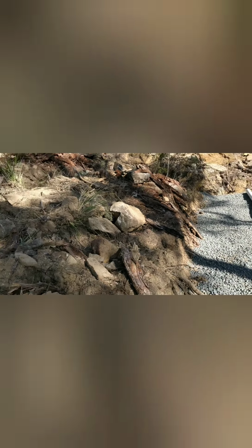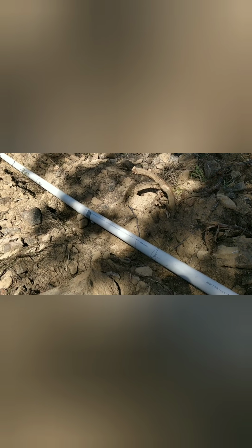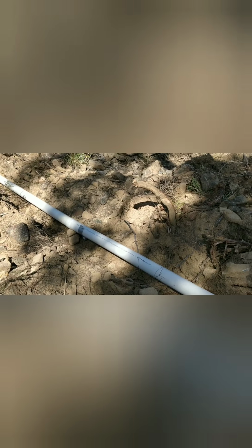So it comes down here, so I need to put a nice plug there, so that'll stop water. So when the water comes down as a part of the trench itself from the dust, it'll stop there and then be diverted around. So this last part here, we want to make sure it's got a good clay in it rather than metal dust, so it doesn't let water pass.